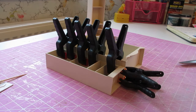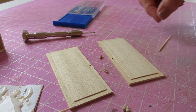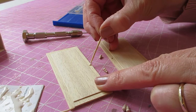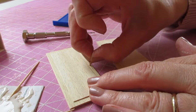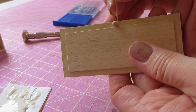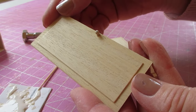In the meantime we'll get back to our doors and attach the doorknobs. Drill the hole in the center of the straight edge of the door, use a little bit of glue, and put the doorknob into place making sure it's sitting flat against the door. Remove any excess glue and that door is now ready for paint.